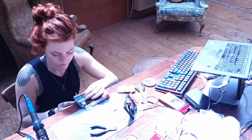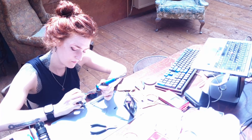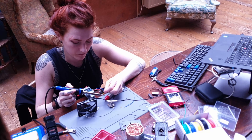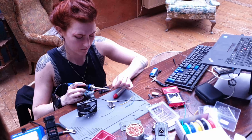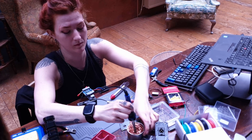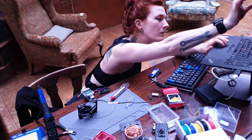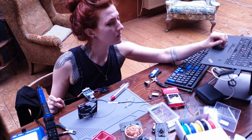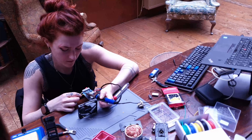While the ESP32 is pretty great, it cannot directly speak to a DMX port, so we'll have to translate that first. We'll do that with a MAX485 module. DMX uses RS485, which is a different signal — instead of flipping one wire between high and low, it flips the difference between two wires. That makes it more stable over long cables, but it also means you can't just connect your ESP32's TX pin to a DMX device. You need something in between to handle the electrical side, and that's what this module does.